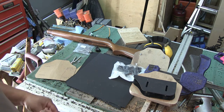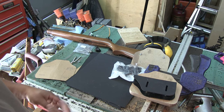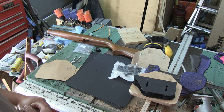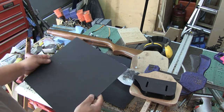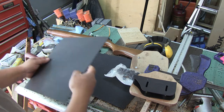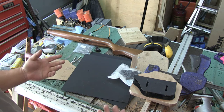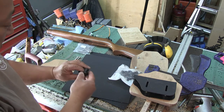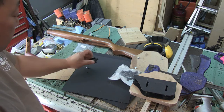That old method was slow, tedious, and generating a lot of waste. So we looked around at the options and thought about buying kydex cheek rests — they were between $25 discounted or $50 or more for production delivered ones. We thought we could make them cheaper ourselves, and we did. We sourced some kydex on Amazon or eBay — I'll put a link to all the products we use. These are around 0.080 or 0.095 thickness; the thickness doesn't matter too much. We also needed 2.5-inch quarter-twenty bolts, quarter-twenty nuts, and plastic knobs where the nut just drops in for a more finished look.